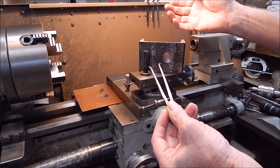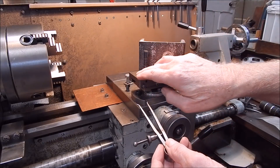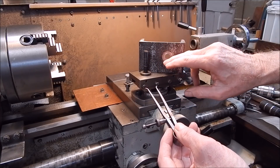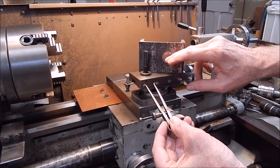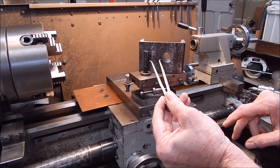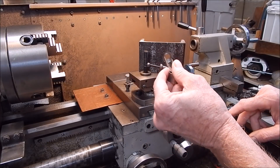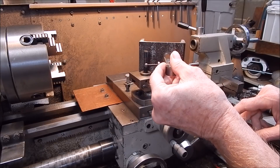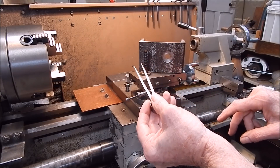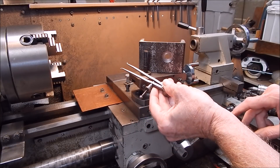I'd say I have a 100% success rate doing it this way. But when you try to do outside measurements matched to inside measurements, there's always going to be error — particularly on the inside — and the number of times you go over is just frustrating. So do it this way, guys: get some dividers, use your dividers, go on feel, and that will work 100% of the time if you do it right. Okay, that's a quick tip from me. Hope you found it useful, and I'll see you next time. Cheers.